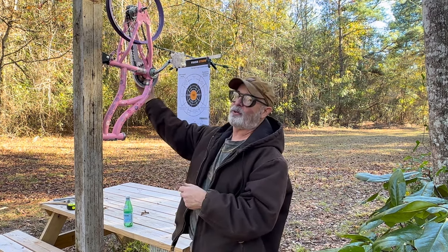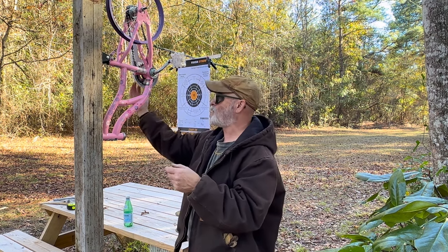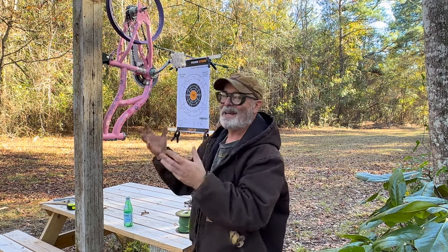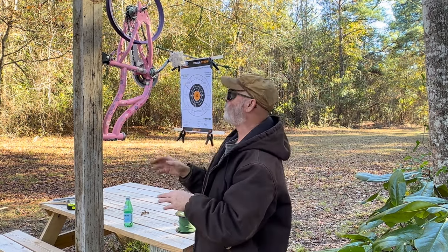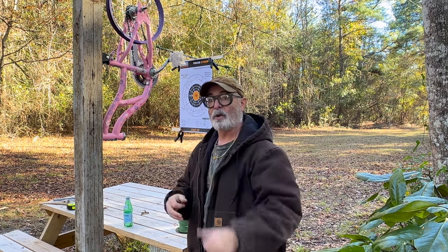There are lots of little things that could be changed on this and probably will be — but this is how I just thought things might work, and that's how we did it, and it does work. The direct drive is a little taxing on the impact driver. It would have been better if I'd done a pulley assist — a smaller pulley there and a larger pulley here — geared so it wasn't having to work so hard. Even so, with the pedal it's effortless. Anyway, it's worked out pretty good and I'm happy with it. I welcome your comments and suggestions — that's how we learn around here. As usual, I appreciate y'all stopping by and good luck with your projects.